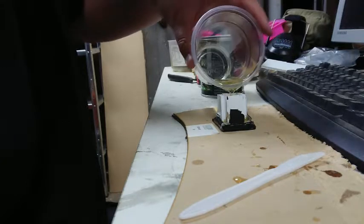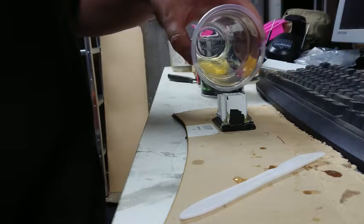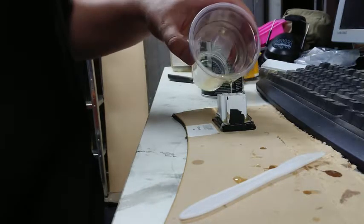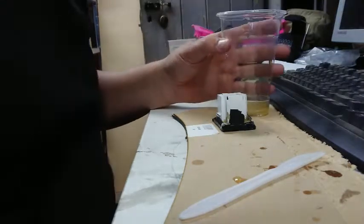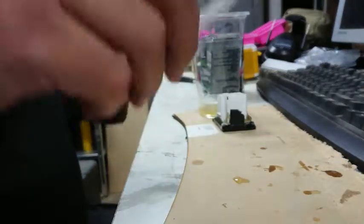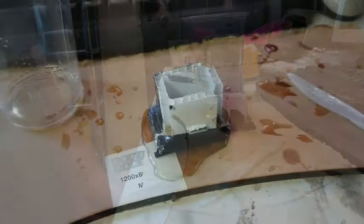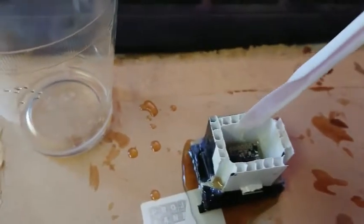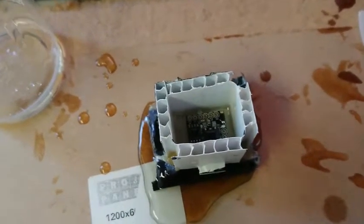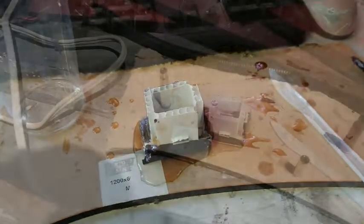I think it shrinks a bit so most bubbles disappear. I'm going to pour all of this in here and cast the whole thing in a single block — I want to leave myself a little bit of room to sand. I've grossly overestimated my mold, so I'll leave the rest in the cup as a test sample. I'll press the lid down. In a quick update, it looks like I need to work on my hot glue skills — it dropped just below level — but it's fairly solid. I'll add new resin and put it out in the sun; the heat, UV, and extra resin should do the job, using quite a bit more catalyst this time.